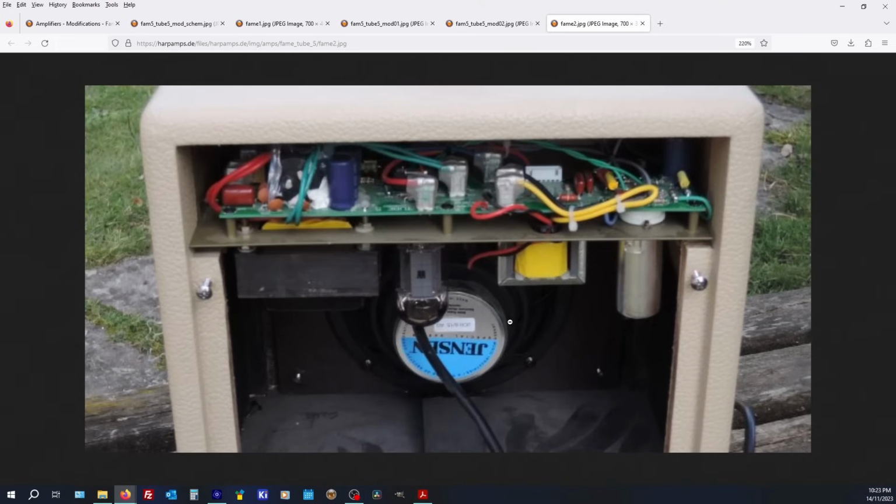This one looks like a much deeper cabinet. Look at that, the valve's totally clear of that magnet. It's hard to tell the depth of field, but that looks like it's a good 2 or 3 inches clear of that speaker magnet. So at some point they've compressed the cabinet right down, and now the valve's actually kissing the magnet itself. But as I mentioned in the text above the video before, a quick way to sort that out is to just put a Tube Amp Doctor 6V6 STR in there, because the bottle's a lot shorter, by a good inch. So you'll be able to actually remove and reinstall that one, but it doesn't help you when you've got to take this one out by either removing the chassis or the speaker.